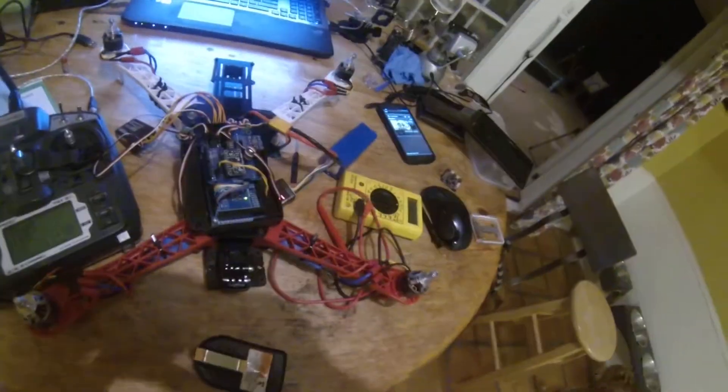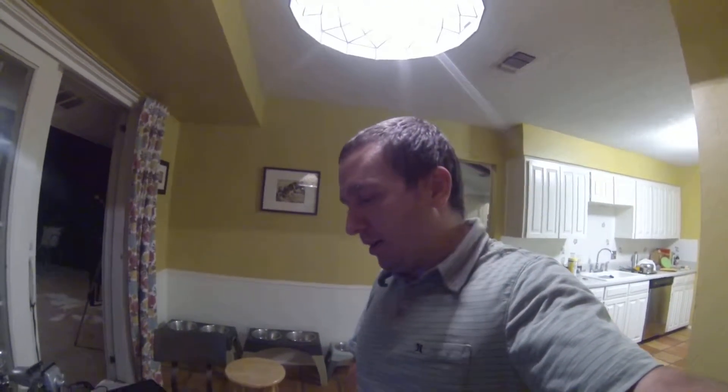So that's it for my quad. The next step is I'm going to put attitude mode in — that's basically where the level of the quad pretty much matches the right stick. That's probably going to take me a little bit to do. I did write a PID controller; I simulated one in JavaScript first because I wanted to see what it was like before putting it in Arduino. Arduino has its own PID library, which is cool and I'll probably end up using it, but I wanted to understand how PID controllers work before using someone else's code. I'll put a link to that in the description and on the blog post. I'll catch you guys in the next video.